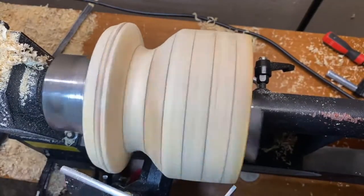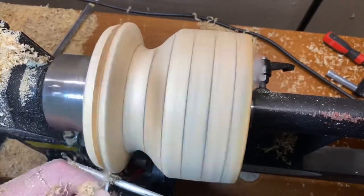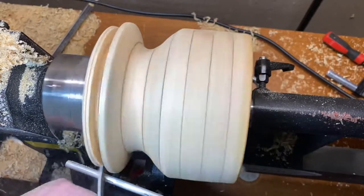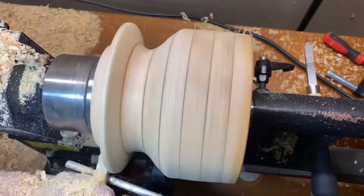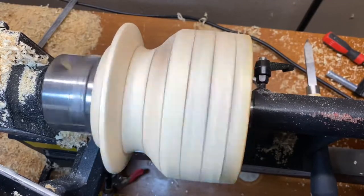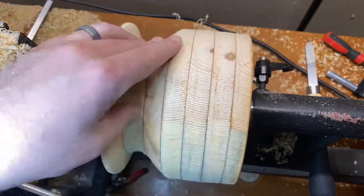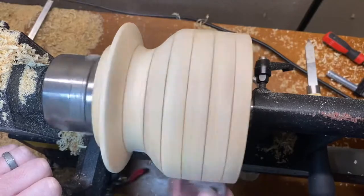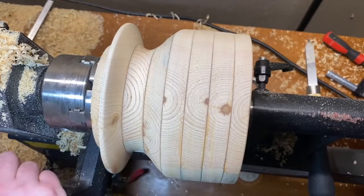I'm shaving away some excess on the bottom here. If you can see that pencil line close to the bottom, that's where I want the bottom of this vessel to be. I'm using the parting tool to define that edge, and I also want to get rid of some of the excess so I can start working on the very bottom of the piece - it'll be easier to do with this excess gone. Check the final shape of it - I have one little hump I wanted to get out with the tool, and then we're going to start sanding. I sanded everything 80 through 400 as I normally do.